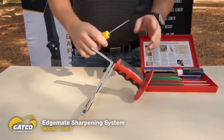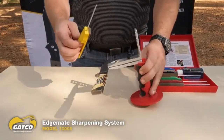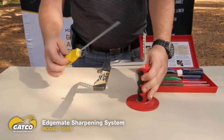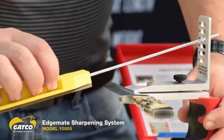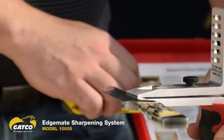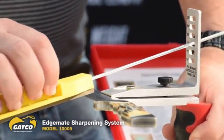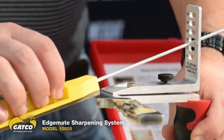To get these rods out — when you pull them out of the box they're compressed, and it's too short to do the work. You just pull the rod out to extend it. Put a little oil on the stones before getting started. Pick the angle you want — there's an angle guide for what you might need. I like to keep a thinner edge on some of my stuff, so I use 19 degrees on my hunting knives to make it so I can just slide through really easily.